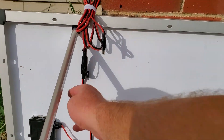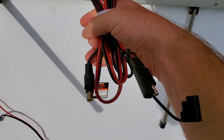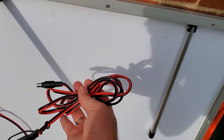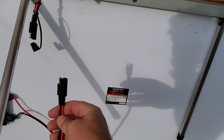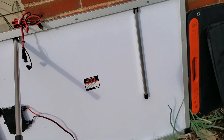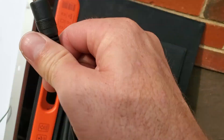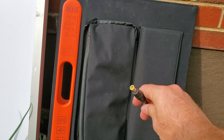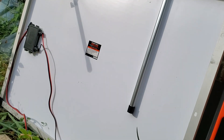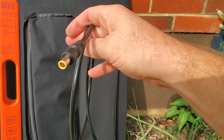The Harbor Freight panel also needs an additional cable to connect to a Jackery power station — about $12 to $15 — to convert the SAE connector on the Harbor Freight to fit into a Jackery. The Solar Saga comes with only the 8mm barrel style connector, which might be limiting in a different way since you can't plug that into very many things. SAE, on the other hand, is common on a lot of devices, though you can get adapters for the barrel connector as well.